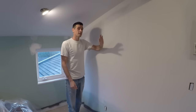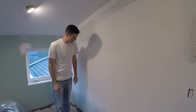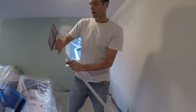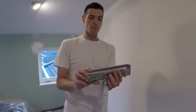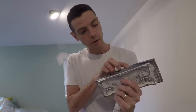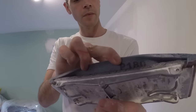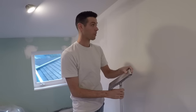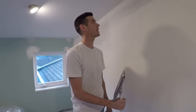I'm going to coat everything in here and then we're going to film the finish coat sanding. Okay, so this is now finish coated and ready to sand. For sanding this coat, what I really like to use is some foam-backed sandpaper. This stuff comes in a roll — it's 180 grit. I find this 180 can be a little too non-abrasive; I like 150 burned down a bit. But we're getting a bit technical here.